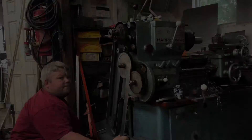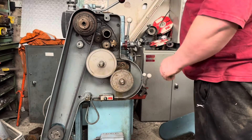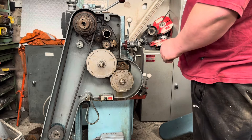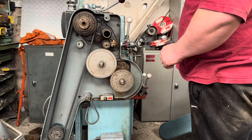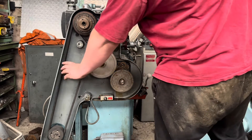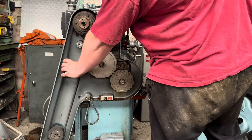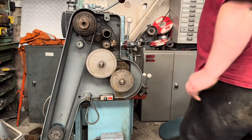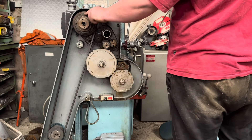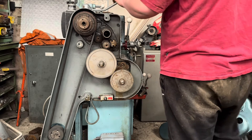Right, so we've refitted the belts and fitted the new higher-speed pulley — bigger diameter. Now let's see what the belt slap is like because we have got a fair bit more belt tension now. We could go tighter but we'll see. You can already hear this clutch — the clutch plate is very noisy.